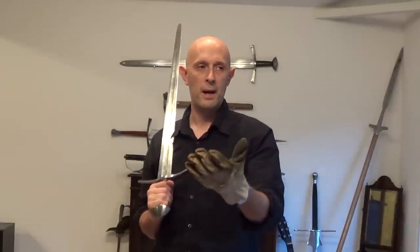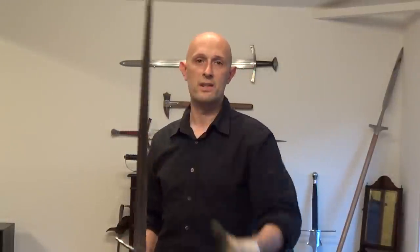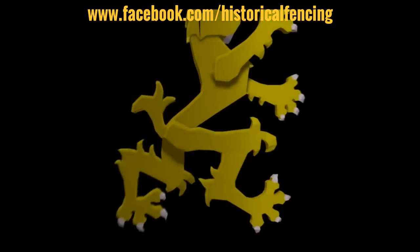There are swords like katanas, some tulwars, some shamshirs and kiliches that are not spring-tempered. If you bend them, they'll stay bent, and therefore they tend to have thick blades to protect them from being bent — to keep them straight. But a stiff blade is generally speaking, in most situations, better than a flexible blade. And you only go for a highly flexible blade if you're aiming to gain lightness or thinness of the blade. There we go, guys, cheers! Click subscribe now and also follow us on Facebook.